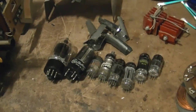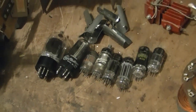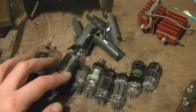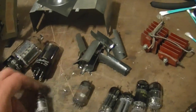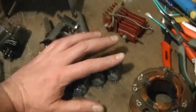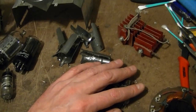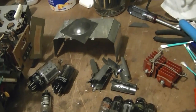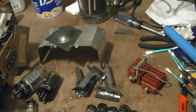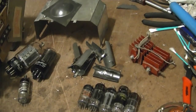So I then checked the tubes, and they were almost all bad, or a couple were broken and one wasn't the right type. The ones that were still good were the most common ones, of course: 17DQ6, 17AX4 damper, high voltage rectifier. The rest, I searched and dug through my stock and found most of them. The two that I could not find were the two that were broken in the tuner. So I ordered a couple of each off of eBay, and they should be here in a day or two. In the meantime, I will start putting this back together.